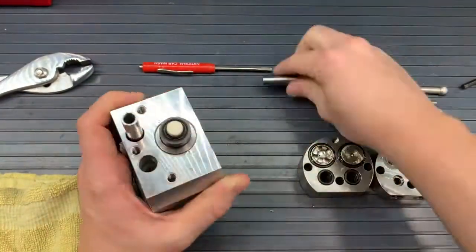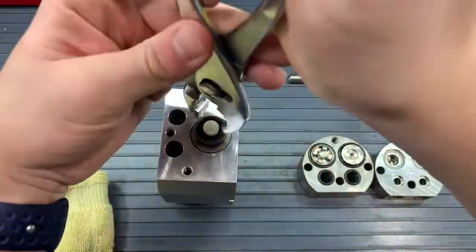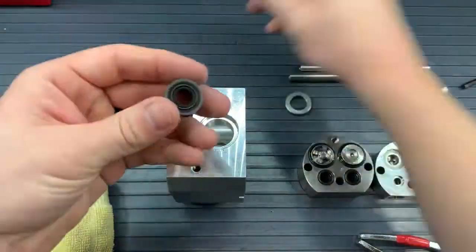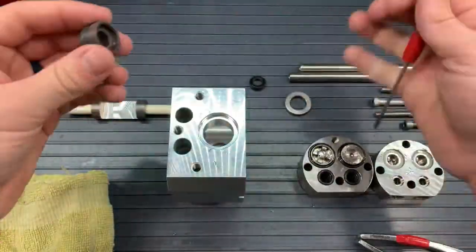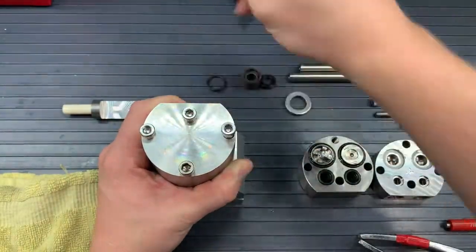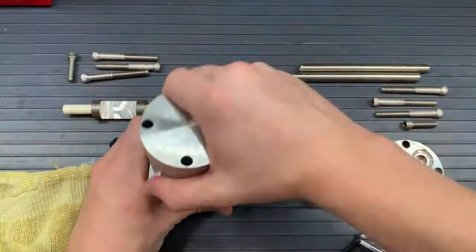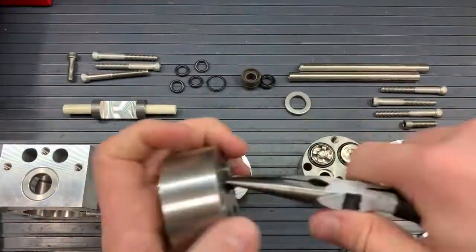You'll see two stainless steel tubes poking out. We'll want to remove both of those as well as the U-cups, plunger guides, and plunger. Once those are out we'll turn to the other side, get those four bolts out, and do the same thing — take out the plunger guide, the U-cups, and the stainless steel washer. There should be two of those in between the crankcase and stuffing boxes.